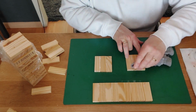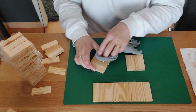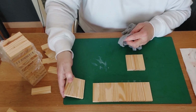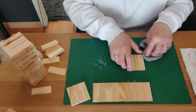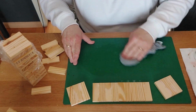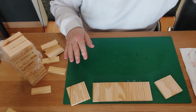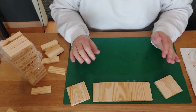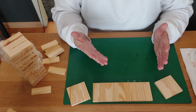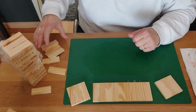So move away the glue, and again, keep it in place and get it up and turn it over and let this dry again. And wipe away, clean your space so nothing glues together, because the glue is giving a lot of stains. And I'm going to paint this bench, but if you're not going to paint and you want to stain it, then you have to sand it first with little sanding paper.